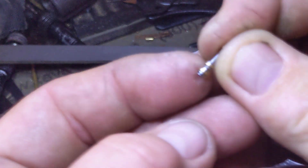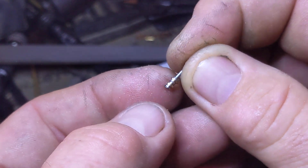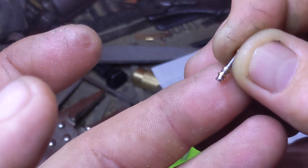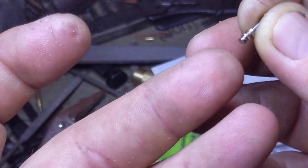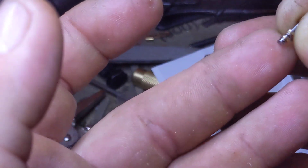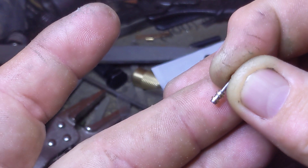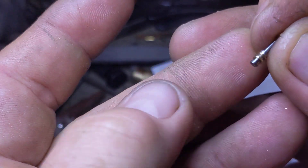Once you get it down to about six millimeters, sometimes you can leave yourself a little bit of space so the head of that nail can drop down in there. Seven millimeters is about the longest you want one of these pins to be to go inside a lock. You pretty much want to use a small key pin with a spring — maybe a weaker spring, that's what I've always heard — but sometimes you might need to just try to see if it's going to work.